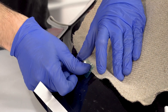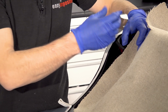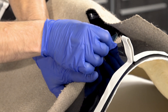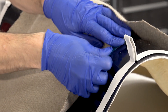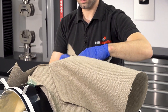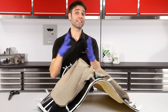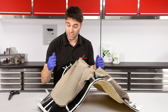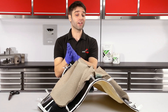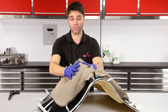A few spots of flash release tape will help keep the material in overall position during the bagging stage. This particular laminate has three plies of 550g twill, all stacked and secured where needed. I've done a really loose job of laying the reinforcement into the mould — I certainly could have gone to more effort with tape and spray tack, but the vacuum can do a surprisingly large amount of that work.